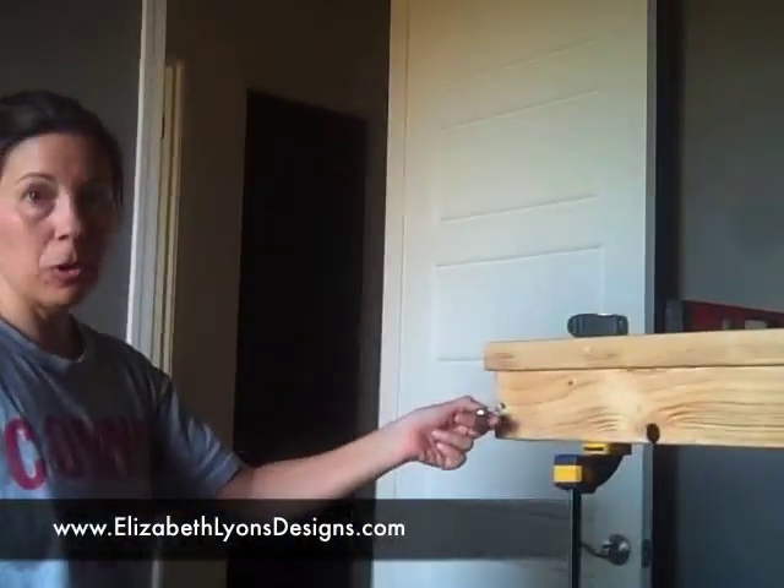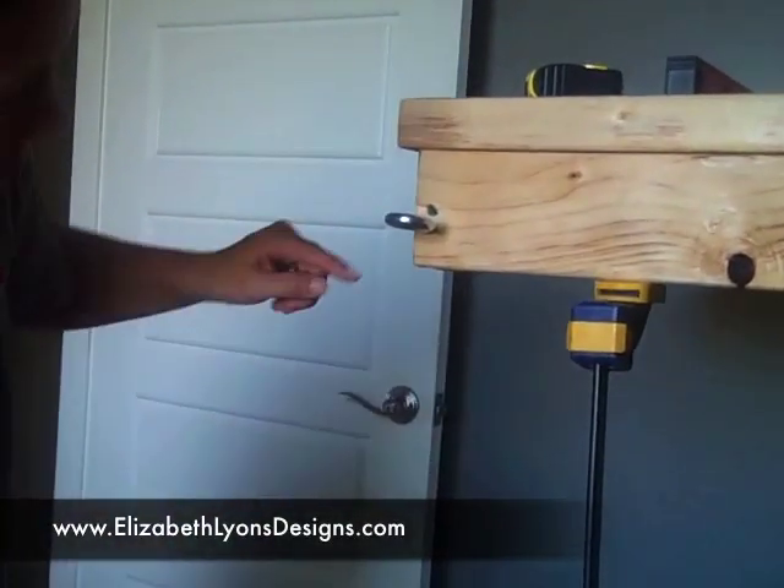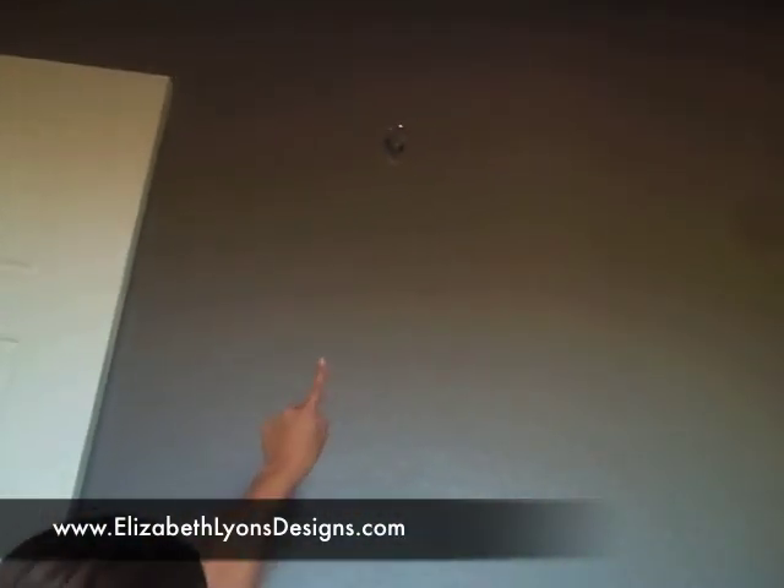When you're finished with that, you're going to put more deck screws — high, low, high, low, high, low all the way across. Once you've done that, the bed is predominantly secure. I still have a clamp I'm using as a jack over here just to give it some support. Then we went ahead and put the eye bolts — these are four-inch eye bolts, three-eighths inch in diameter and four inches long — in here. You're going to want to go kind of low so you don't hit the screw that's already in there. Then up high, basically measure from your wall to the end — in my case it was 45-and-a-half inches — so you go from here up 45-and-a-half inches, find your stud, and put that in at an angle so it's coming down a bit.